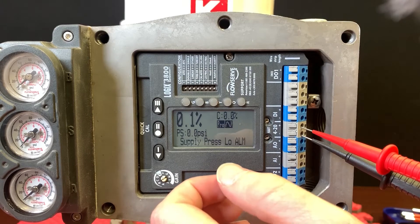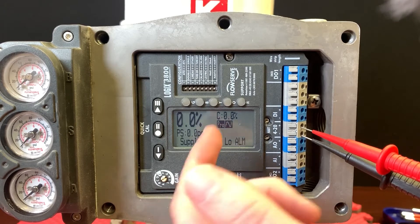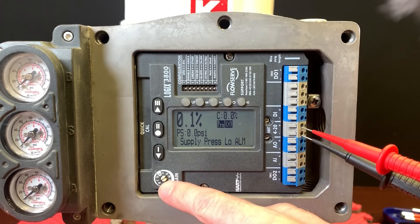For tuning: are we auto-calibrating or are we jogging it — which is basically moving it manually to the limits it's going to travel. Low friction or high friction — for some of the larger valves with sticky packing that helps us avoid stiction issues where we kind of jump once we're close. It's trying to prevent the positioner from always hunting with big valves and overshooting.